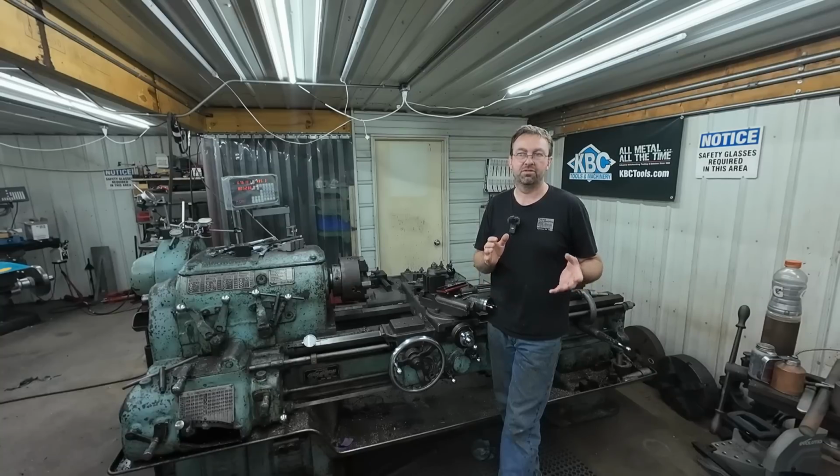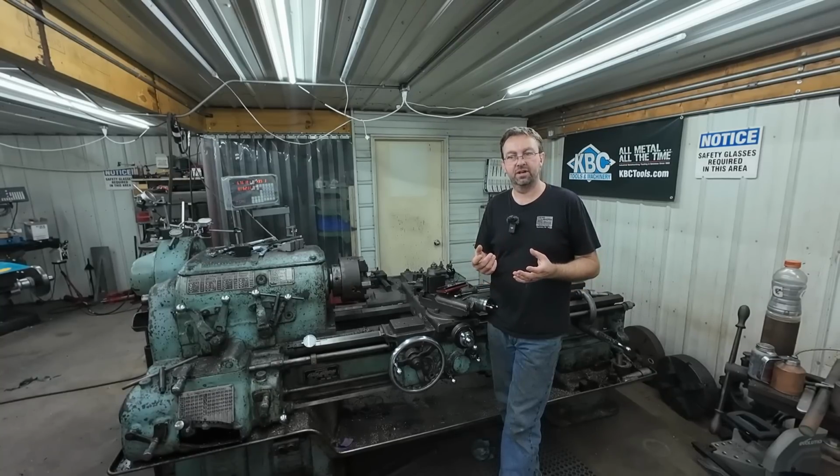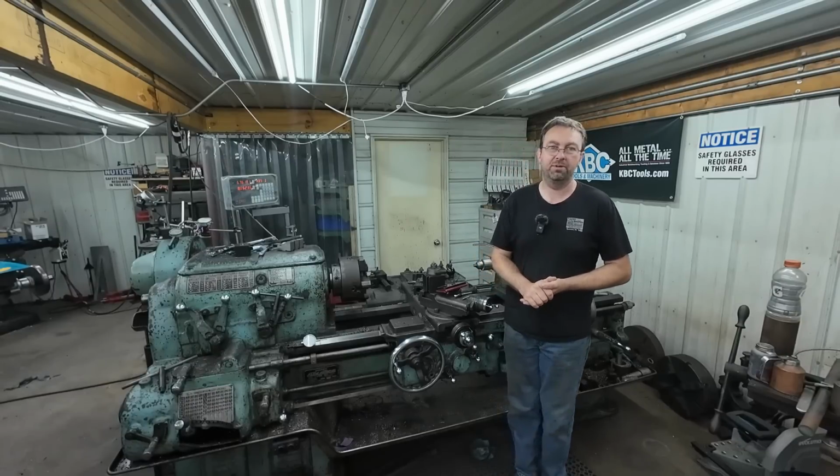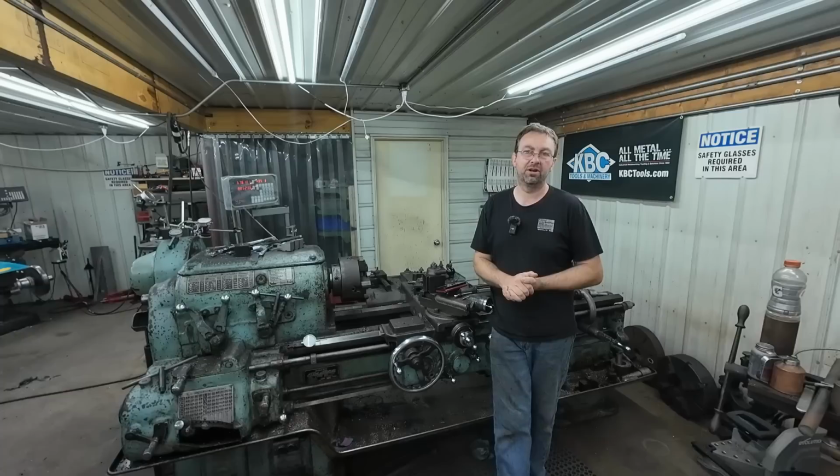And especially, the other thing is impurities. They'd been running like that for a very long time. Dirt ground into that, bronze ground into that, so there's going to be impurity. So the weld is never going to be perfect either. You're going to get bubbles, and it would be a bad situation. There's no way I would ever consider that.